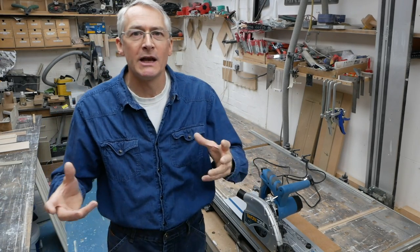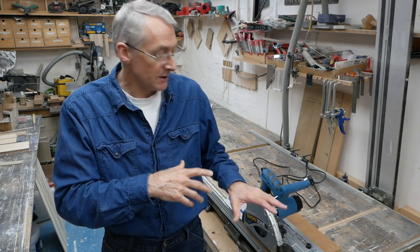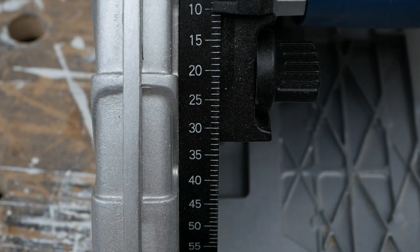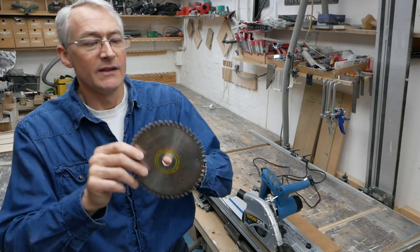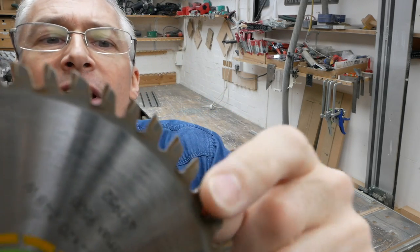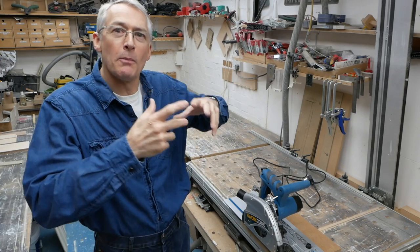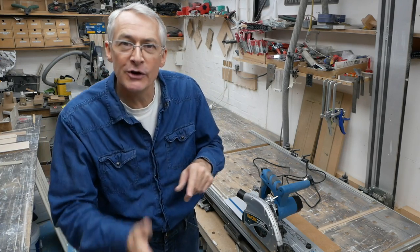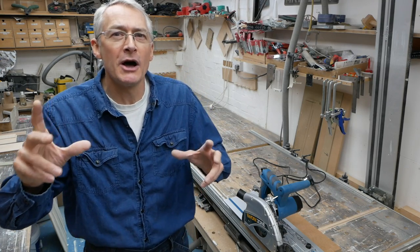When it comes to using your saw in earnest and managing the depths of cut, what we did when we trimmed back the splinter guard was almost perfect. What you need to be aiming for is about 3mm deeper than the material you're cutting. So for example this piece of 22mm board plus the 5mm of the track gives 27mm, and then 3mm more means we can set the depth of cut to 30mm exactly. The reason for that is if you think of a circular saw, all these little teeth are like tiny little blades. As they turn they slice through the material, and when it gets to the bottom of the cut — the deepest part — you want those blades to slice through but not actually come out of the material. You want the blade to be contained within the material, and a 3mm depth over and above the depth of the material and your guide rail is almost perfect for that.